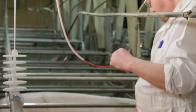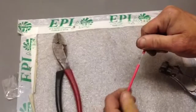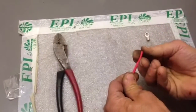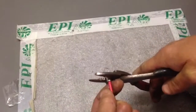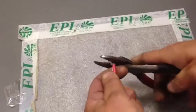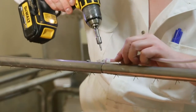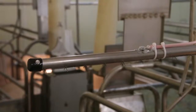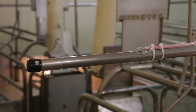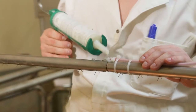Attach the high voltage wire to the corona pipe runs. Strip a 3/4 inch section of insulation from the end of the high voltage wire. Twist the strands together. Fold the strands back over the high voltage wire and slip a ring terminal over all. Crimp the terminal to the high voltage wire. Repeat the process for each end of the high voltage wire being attached to the corona pipe runs. Use a self-tapping screw to attach the ring terminals to the corona pipe runs. The ring terminal should be at least 4 inches from the end of the corona pipe run. Secure the high voltage wire with two cable ties. Cover the ring terminals and high voltage wire ends with silicone caulk.